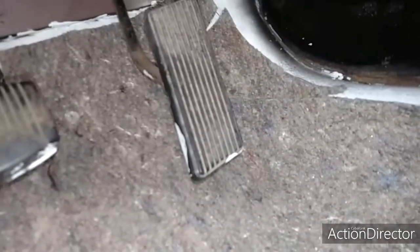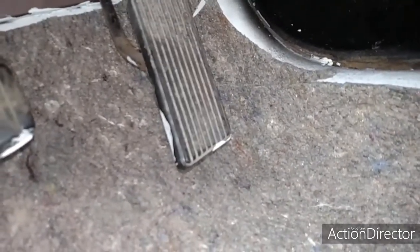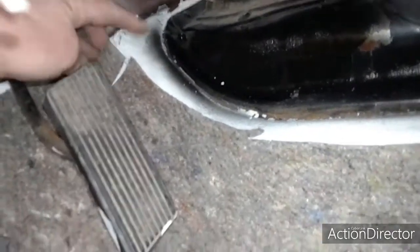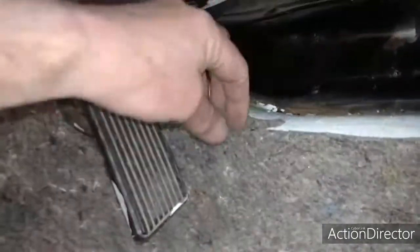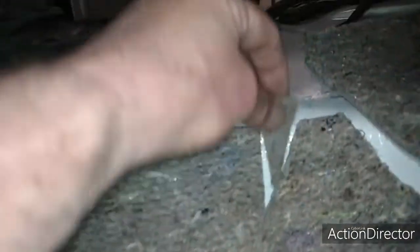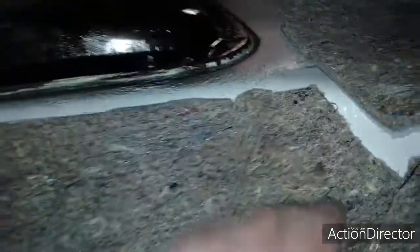This padding is for commercial use - like if you go into office buildings and stuff, you notice they've got that real short pile carpet. This is usually what's underneath it. And if you can see my slits here, I made these slices - you pretty much just overlap the stuff and then kind of trace it with the razor knife. Here I screwed up, so I always have to put that little piece in there. And this I had to cut back for this strange rounded corner, and then that will all kind of get pinched together when I glue it. So yeah, pretty much ready for glue.